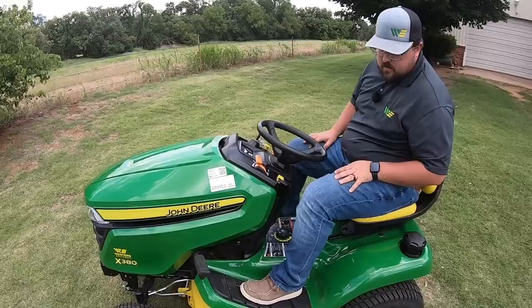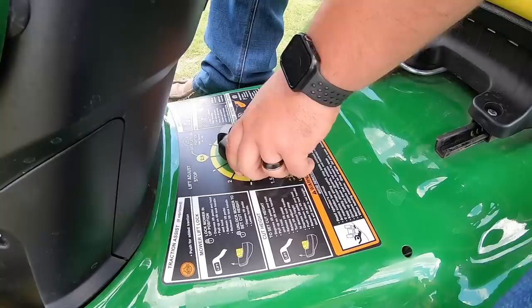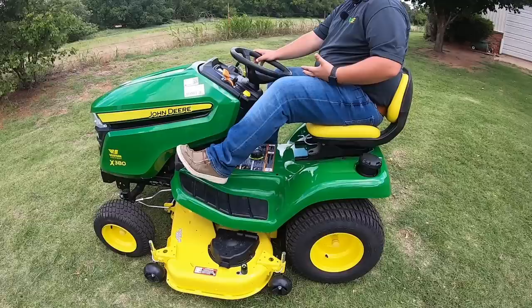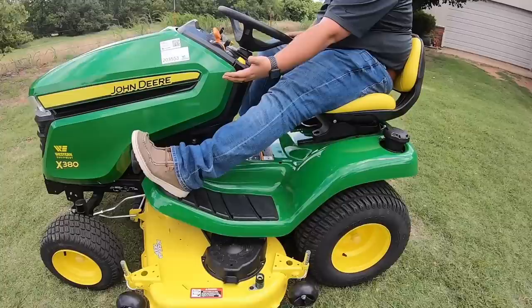In the operator station, starting over on my left, this is our deck raising and lowering lever. Pushing it raises and lowers the deck, but when in transport mode, the height adjustment is done with the dial down here on the floorboard. Right now we're set at about two and a quarter inches. If I want to go to three inches, I turn that dial, raise my mower up, release the lifting lever, push it in, and we go down to that three-inch mark. To return to transport mode, push all the way with my foot and raise this lever to lock it back in.